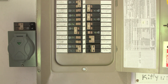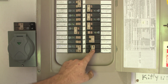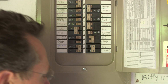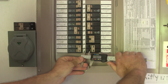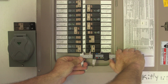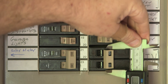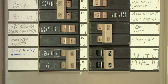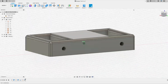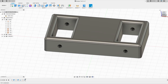It's just in this case I've got a couple of things that are a little bit weird about my property that don't work out well for that. So I thought I'm just going to make something to make sure there's no way I can have both these breakers on at the same time. What I did is I got my good old Harbor Freight digital caliper out and I just did some measurements — between the handles of the breaker, on the outside handles of the breaker, measured the height of the breakers — just so I knew what size and shape I would need. Then I went to my computer, did a little bit of CAD work, and I created a shape and printed it on my 3D printer.